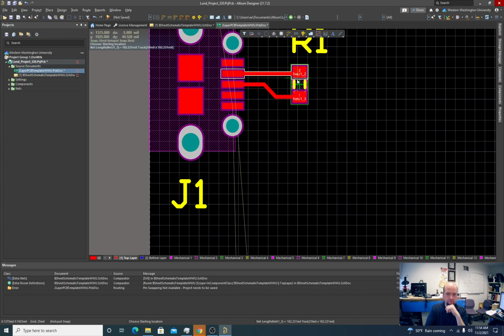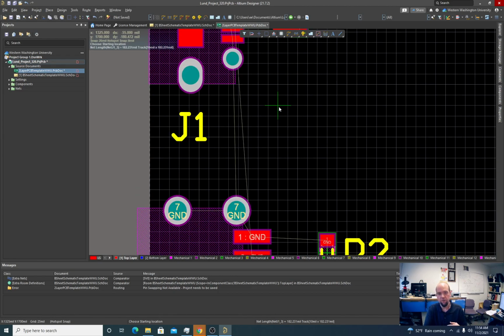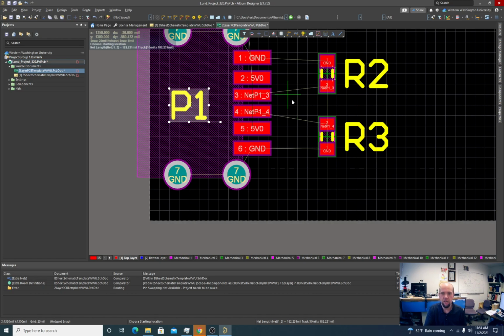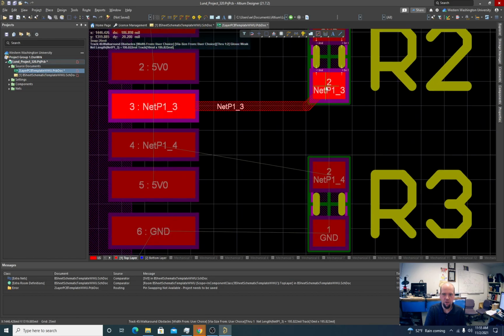And when that happens, the solder is sort of physically flowing over the surface of the board, and things at funny angles sometimes have issues. There are companies that do that type of soldering because they have thousands of devices being soldered very quickly. A lot of those companies have employees who spend a long time finding the best way to get that to not cause issues, because even one in a million type errors would be a problem. So this going in at a corner, some people don't like that. I'm gonna do that. Okay.